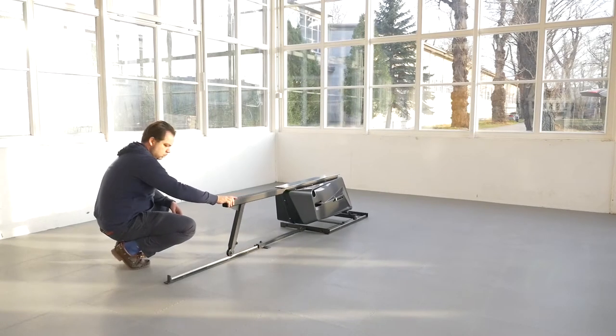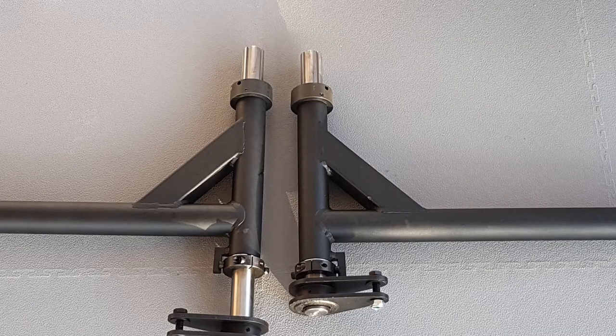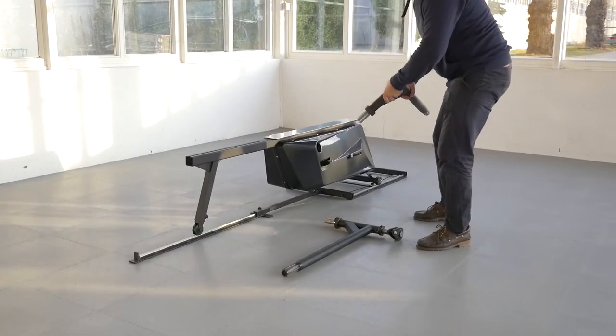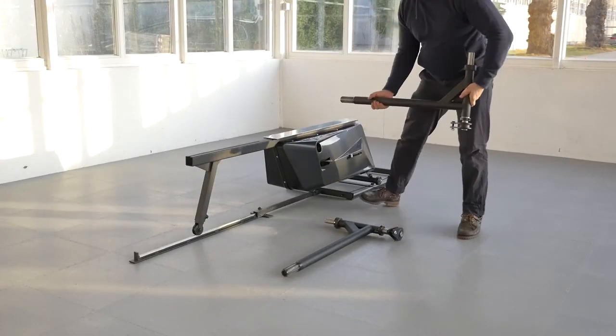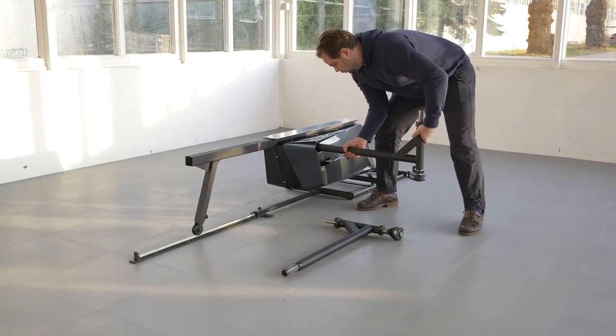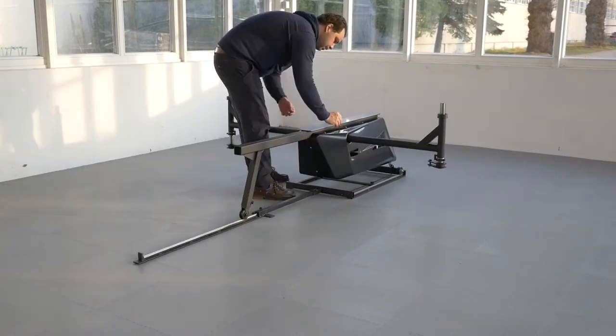Then put on the front wheel. Now it's time for the riggers. There are different heights and also different distances on each side of the cover — a shorter and a longer side between the hole for the draw bar and the hole for the rigger. We start with the shorter one, which is the left side. When you insert it, hold it well in balance and you'll hear a nice clunk when it's fully inserted.